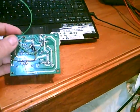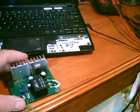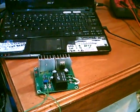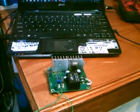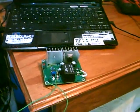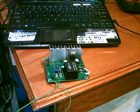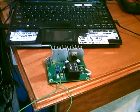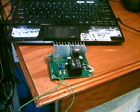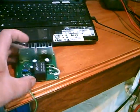This is my spare board — it became my spare board because I blew it up. I wire things up quickly and have things dangling in the box. The capacitor bus went over and hit the heat sinks, which are electrically connected to the FETs, and I shorted one out. That probably put around 300 amps onto the FET because I have a fairly large capacitor bank. But they are repairable.